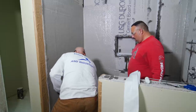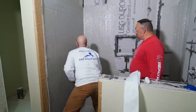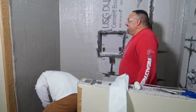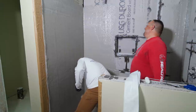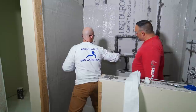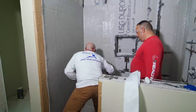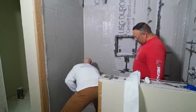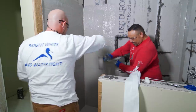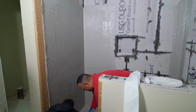Let's say the whole tub is done. I'm not putting any pressure — I'm just getting it wet. I'm not trying to add a whole bunch, but I am trying to make sure I've got some material in there for sand to stick to. It has been installed — no dry fleece anywhere. Just enough of a good layer, taking that excess material and giving a little bit more for the sand to stick to. Be careful around your reinforcements not to mess them all up. As fast as you can, get it up, get it done, and then flatten that bottom and we start feeding sand. With the drips, you can see why you want to do the bottom last — it'll flatten it out and make it nice and pretty.